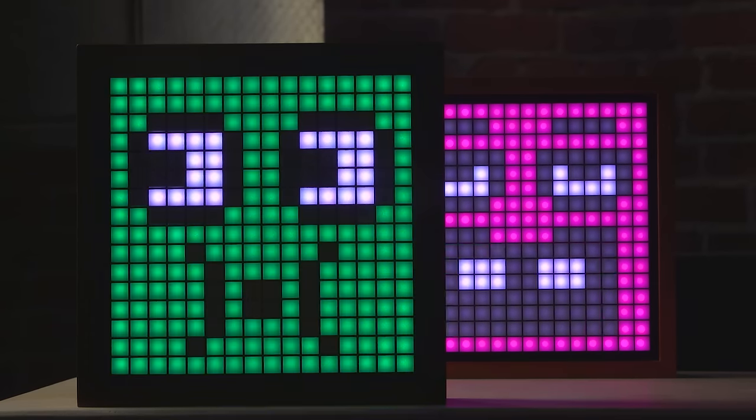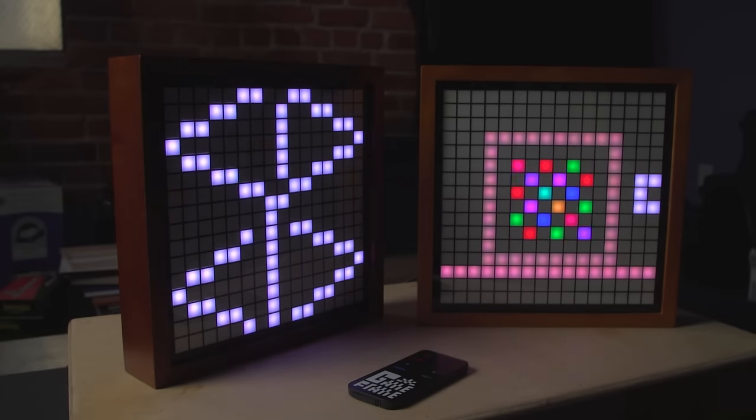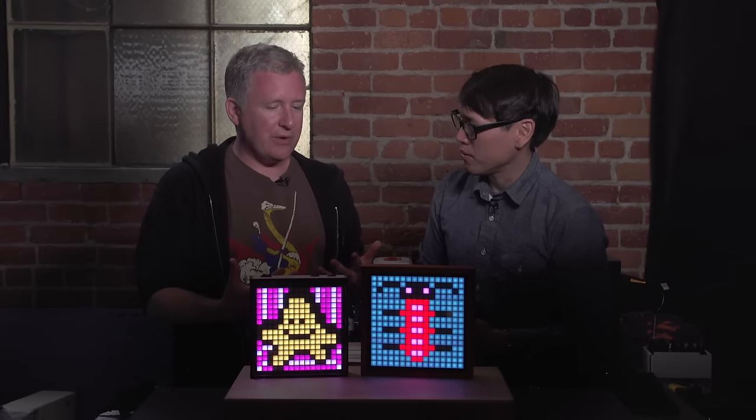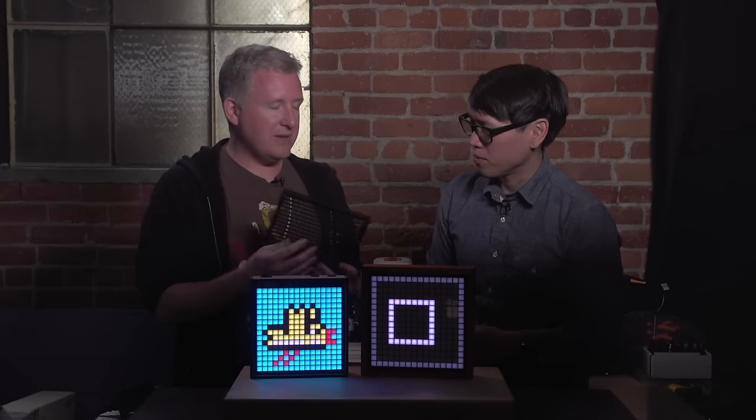There's a lot of new manufacturing in this. Instead of laser cutting individual frame pieces you have two different finishes. One of the big development challenges was the grid to isolate the pixels — it was originally machined with a CNC mill and there'd be all these burrs everywhere, requiring a ton of work. So the major investment this time was making an injection mold to do that properly, producing this beautiful one-piece of plastic that secures the circuit board, centers every pixel, and has no burrs.